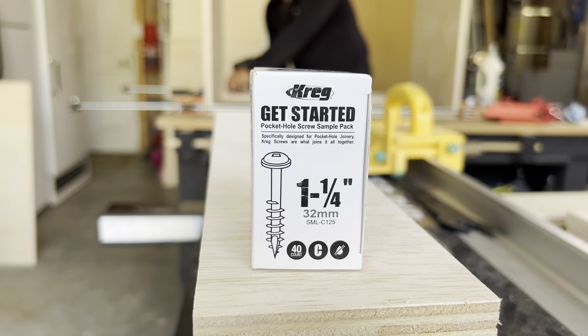So a concern we encountered when building this that I didn't anticipate — these ceiling plates are going to allow the threaded rod to come down and pull the saw upward. They're not designed to be a super tight fit; they're designed to suspend things from the ceiling. So you're going to have some wobble, and you can't have that in the middle of a cut with your miter station. But if you put a lock nut on it, you can cinch that down — I'll just do it hand tight to demonstrate. Boom, it's solid. It's not going to wiggle around. So that's tragedy avoided.